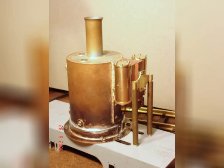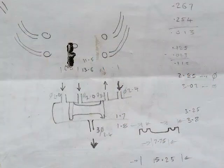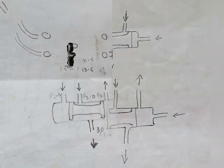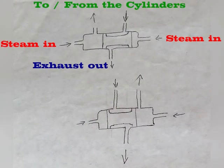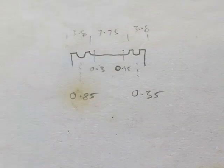Facing the upper and lower parts are the two split big ends, super-glued to the faceplate — these are brass. One of my best achievements to date is the reversing valve. I had seen them on other models but not the internals, and I had to figure out how it all should work — and it did. I'm not sure I could do this now; luckily I kept the sketches. For aesthetic reasons I didn't want a rotary valve on top of the cylinders — I wanted the reversing arm to go to the approximately correct position.